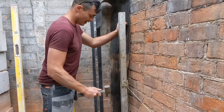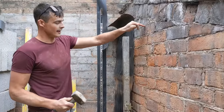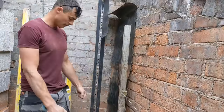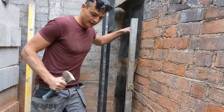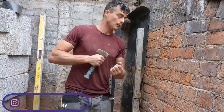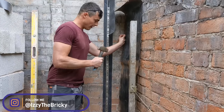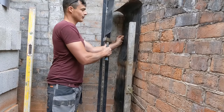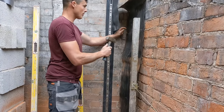Because this brickwork is only touching this nine-inch wall down here, moisture can easily come through. If my brickwork is touching that, moisture can transfer through. It won't fully transfer into the cavity but it could, because this job has a small cavity — if we had a 100mm cavity we'd lose more space. So we're having a tighter cavity and we're going to batten it out with tray and insulation later. This tray will just protect this whole panel from penetrating damp. It's just extra precaution and when we get above this wall it won't matter too much.